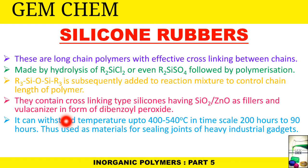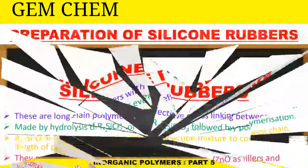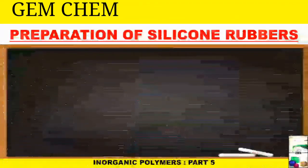Silicones can bear huge amounts of temperature, which is one of the most important advantages of silicone materials. The cross-linking of silicone rubbers is done when two linear silicones are linked to one another by a –CH₂–CH₂– linkage. This is achieved by taking in the same reaction mixture dialkyl dihydroxy silanol along with a very small amount of dibenzoyl peroxide, which is added after a certain chain length is achieved.